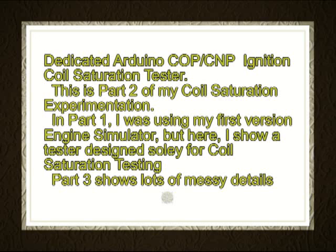In building a specialized homemade engine ignition ECU for my wood gas to electricity projects, I need to know the correct amount of coil charge time, or dwell, needed for the coil on plug or coil near plug packs that we want to use. This setup can characterize the coil charging profile of just about any 4-wire COP or 4-wire CNP pack, single cylinder, or of the 2-tower wasted spark type.